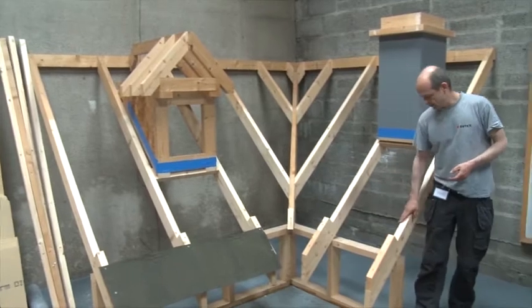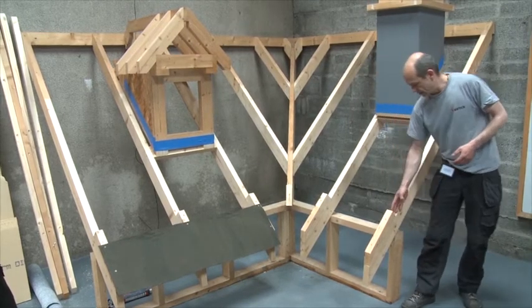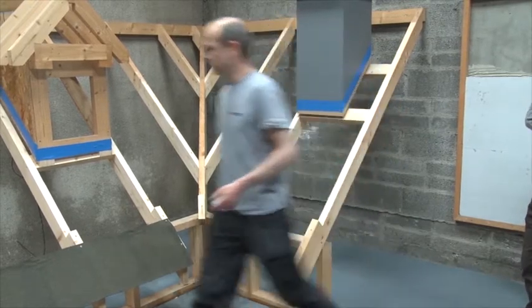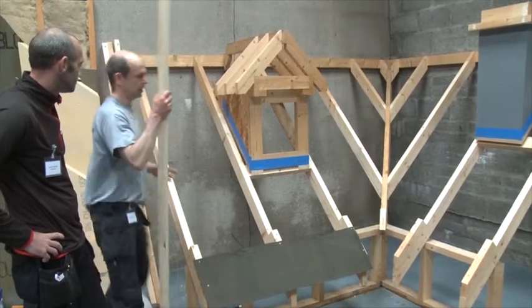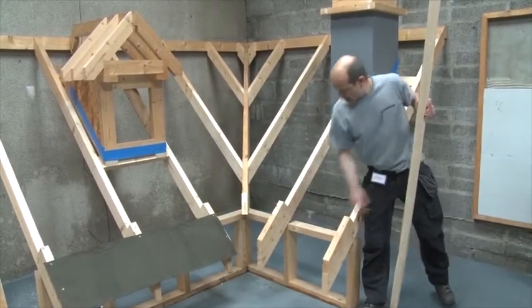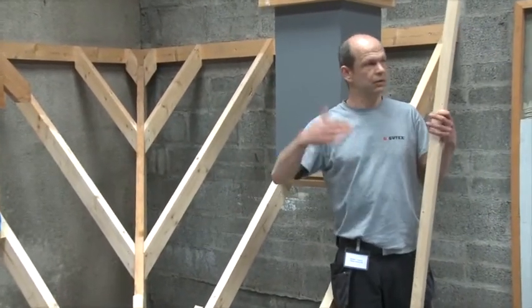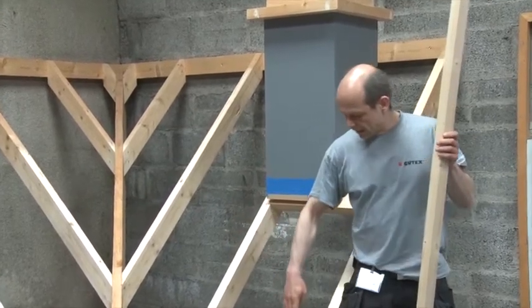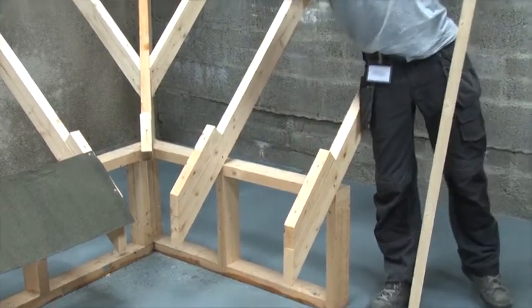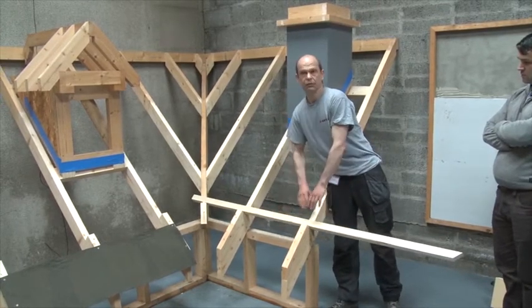What we show here are the filling pieces that Uli mentioned earlier. They are basically the base for the boards to sit on. You can do it this way, but it's not the only way. An alternative is to start at the very bottom of the rafters and use the end of the rafter as your line — but then you are wasting material. If you have a 600mm overhang, which can happen at a passive house south-facing, you are wasting a good bit. So I like to start at the insulation level of the external wall, where the external wall insulation meets the roof insulation, bringing that into one line. That can be done using filling pieces, or you could install a batten cross-wise and that gives you a good starter track.